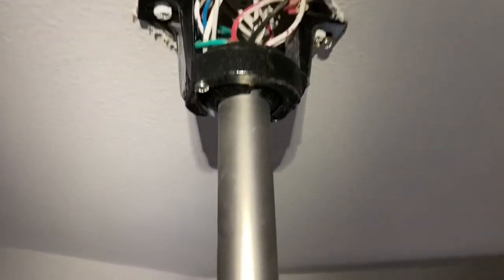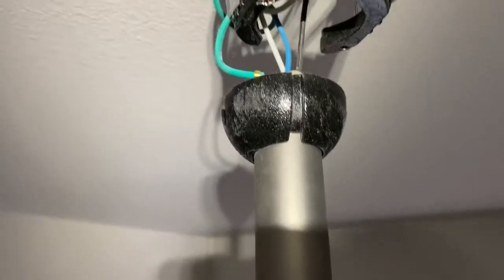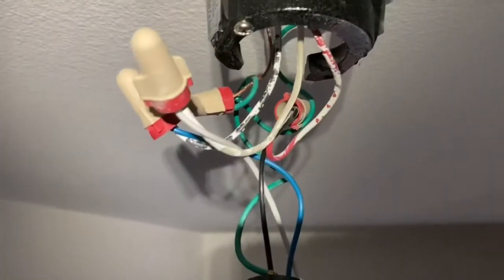Just to give you some idea of the anatomy of this: the down rod and the entire weight of the ceiling fan rests on this little bracket — can you see that bracket right there? The big thick bracket, it's like a circle. I just took that ceiling fan out and I'm bearing the entire weight of the ceiling fan with my left hand with my camera in my right. So I had to undo those wires, and that's pretty simple to do. And now we have the entire ceiling fan removed.